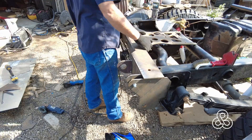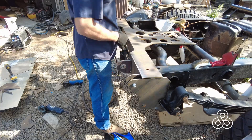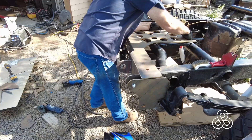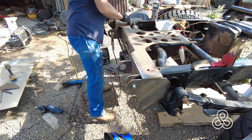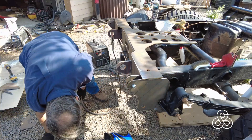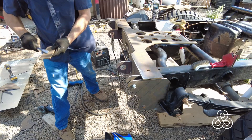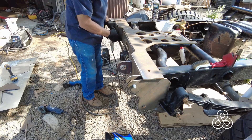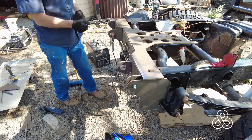This top plate is the last piece that totally encloses and creates the whole box section structure of this bumper. It makes kind of a T pattern, and there's a bunch of holes on that top piece — that was actually where the winch was going to bolt. But after getting this far I realized that once this thing's welded together the bumper would never come off, since it's wrapped around those crossover tubes. So I ended up cutting this piece off the top section. I'll be building another whole box that will bolt to the top here to hold the winch, and that box will be able to come out fairly easily so I can use it around the front as well, or remotely to help somebody out in a place where the truck can't get to.